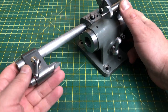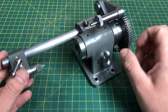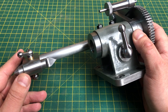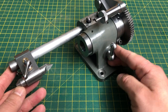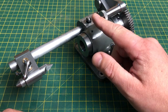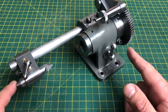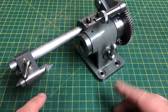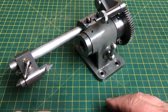And there we are. These parts are really unnecessary embellishments. There are any number of ways to produce handles that are considerably more straightforward than this, and to be honest, for the tailstock the cap screws that were already in there would have been perfectly adequate. That being said, in my opinion these really do look good, and I am very pleased I took the time to do them this way. With the exception of the holes in the gear and the plunger setting to length, what we have here is the basic head complete. Next time I'll be making a start on the components required to attach division plates to drive the worm and wheel, so please look out for that if you're interested. Do leave any thoughts in the comments, please subscribe, and hopefully I'll see you again. Cheerio.